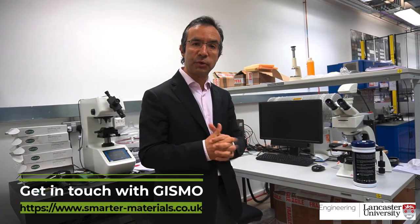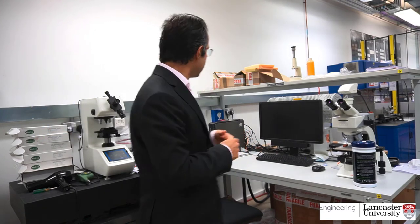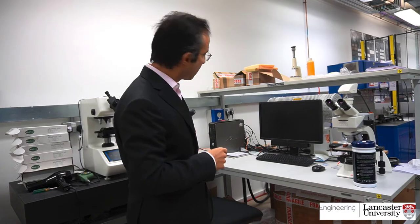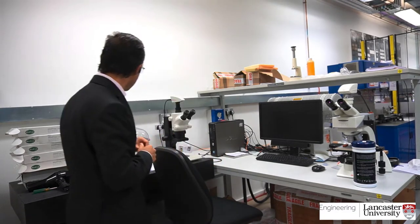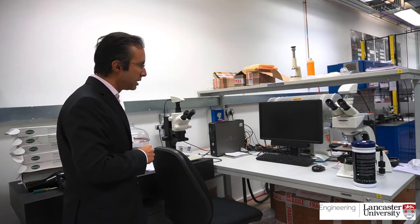The atmosphere can be controlled — so it can be an inert atmosphere so that rapid oxidation doesn't take place. In summary, this is the range of equipment that you need for cutting samples, mounting them in bakelite, polishing them up to a mirror-like level so that they can be inspected in a coarse manner or in a very fine manner with various microscopes. Hardness can be tested, and this could be the result of heat treatment with some of the furnaces that we have here.